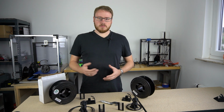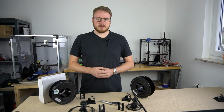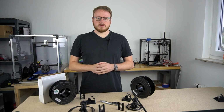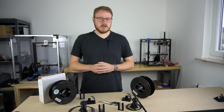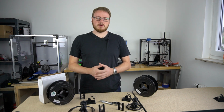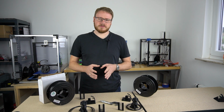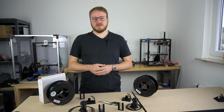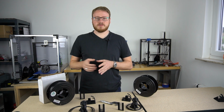After drying, the A quality showed good results. The printed parts had a good quality. The diameters of both filaments were pretty constant between 1.73 and 1.78 millimeters. So I don't say OWL is not good, but I'm disappointed with the result of this test, because it seems that OWL has differences in the quality of their production lots.